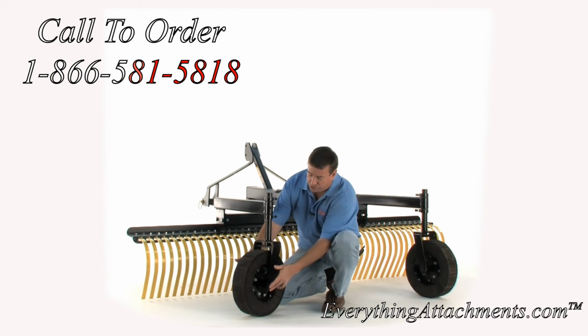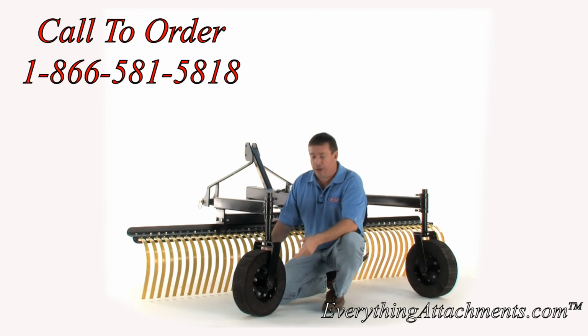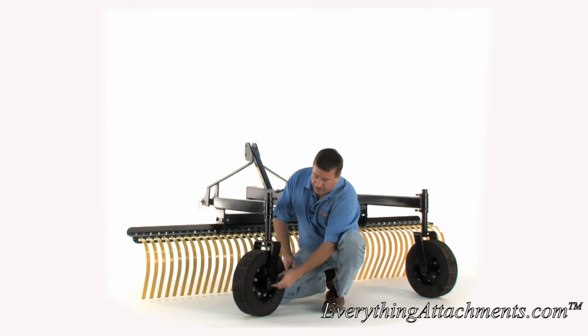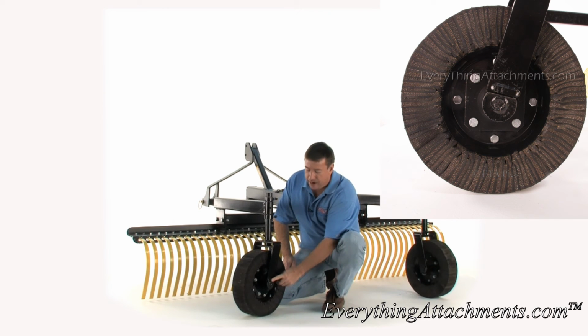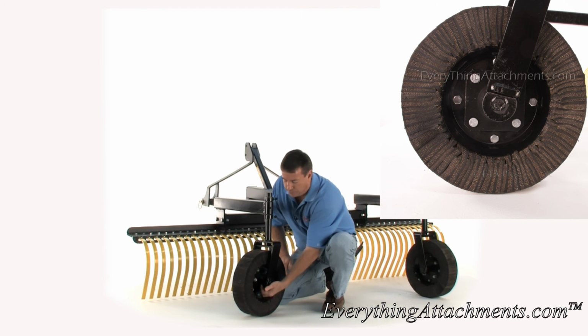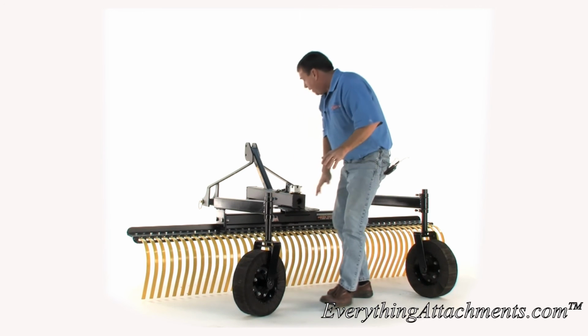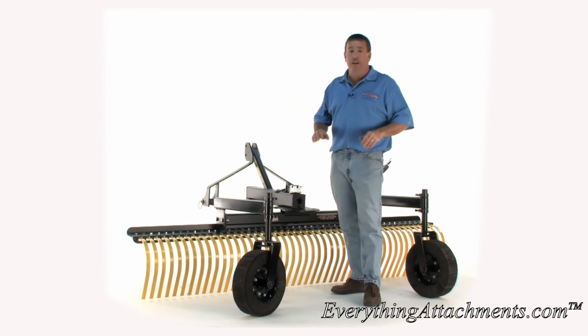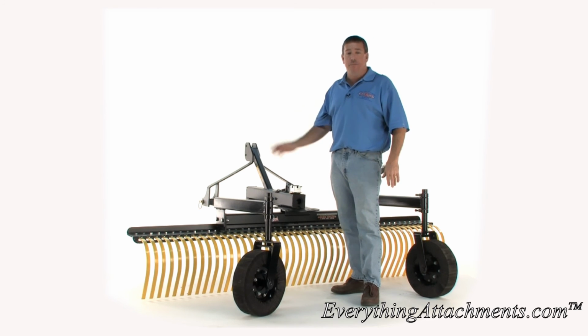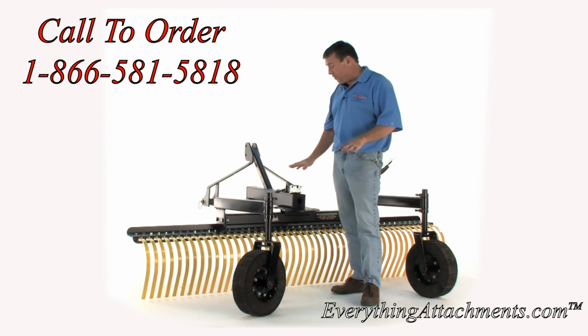And then we do some simple things like I noticed on most of the rakes that we had. Well, they had an axle through the center, and there are bushings in the center of this wheel that can be greased, but when you spun it, most of the axle here would spin with it. So then that would actually wear your yoke. So we cut part of the washer off, welded a tab here, and no matter what, the axle cannot spin, and it will have to spin where the bushings are and where the grease gets. So it's just a matter of trying to keep, I've had probably 5 different designs that I've scrapped and changed to come up with what, for now, is my final design.